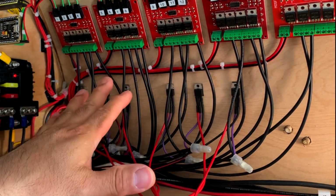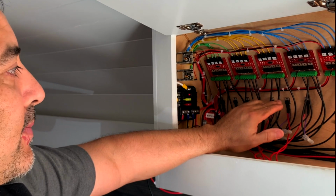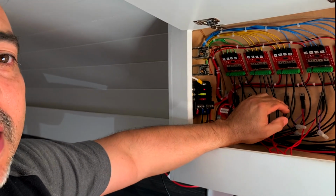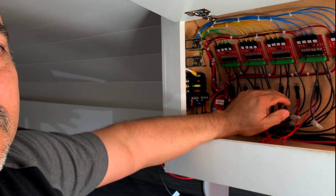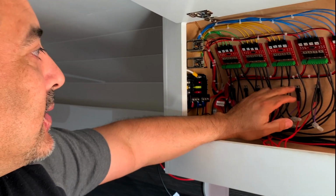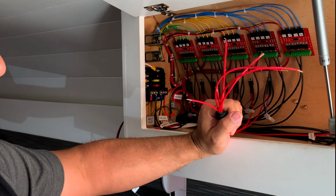So anyway, the way this works is the light will take input from the MOSFET board or from the override MOSFET themselves. If both are powered, it'll be powered at 100% because this MOSFET does not switch on and off. It just gives the full negative. It just works like a simple on and off toggle. And so it will give full bright to whatever is manually overridden. Anyway, so these have to be wired up to switches. So we'll be doing that next.